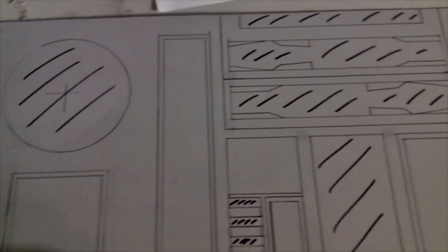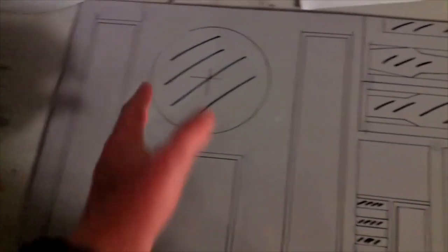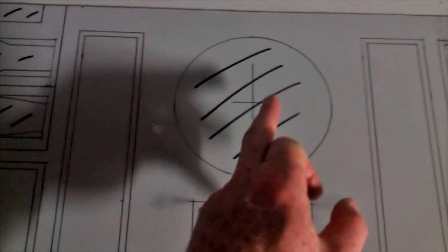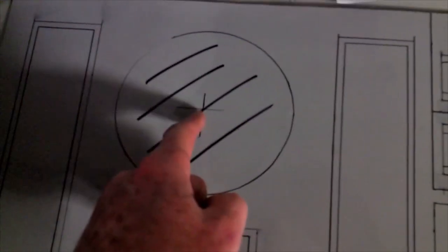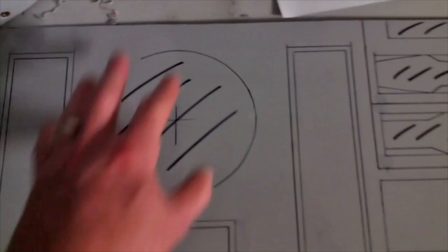The thing you have to make sure of is that they are exactly central when you wrap it around. Just remember that they're evenly spaced. So from here to here, plus here to here, I'll do it again. From here to here, plus here to here, has to be the exact same measurement as here to here. Alright? That way when you wrap it around, these holes will be exactly opposite. Everything else, you can work as you go, but generally that's how it's going to be.